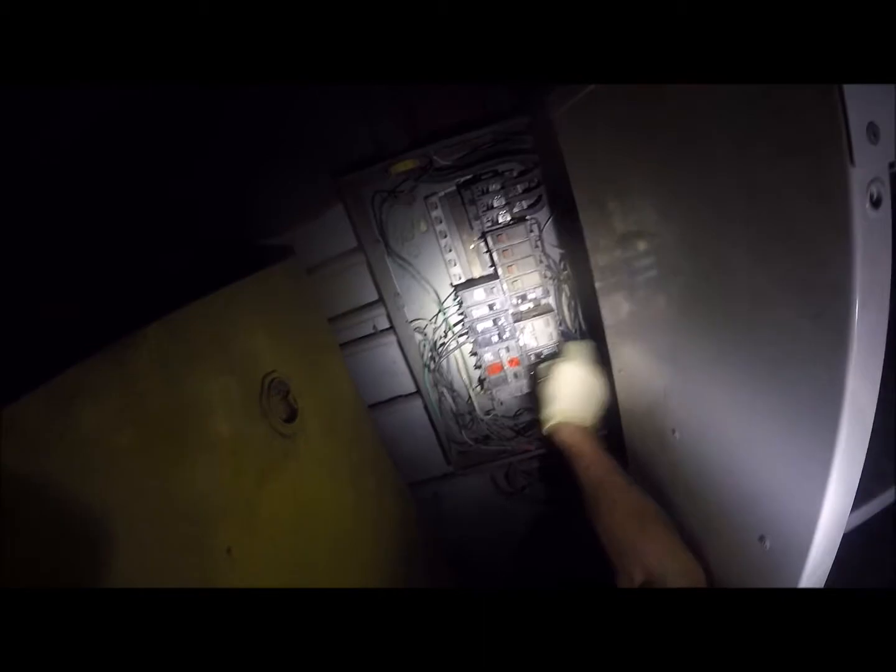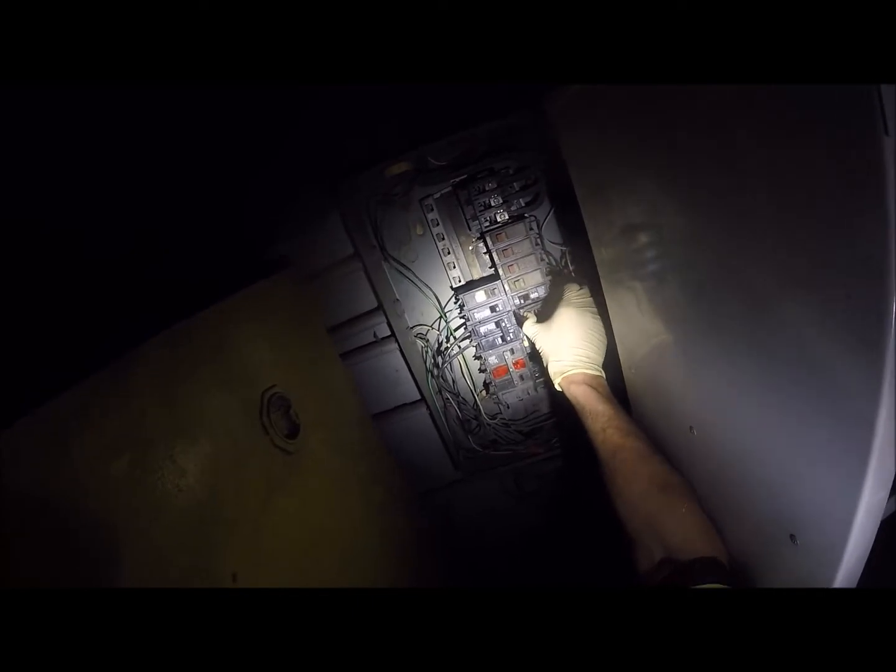What I am going to try right now is change this breaker back to that line. I wouldn't. And see if we have any issues, because I think that's where our bigger problem was. Yep, arcing. Did you shut it back off? Yeah, I turned the light back off. It arced. Well, it's not going to arc right now, because there ain't no load going to it. It was arcing. You want to flip that switch and show you? No, that's okay, I understand you.